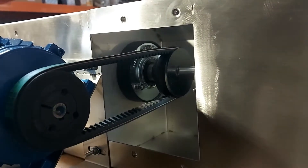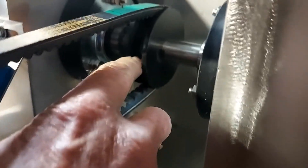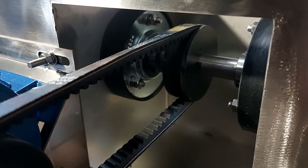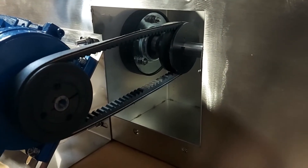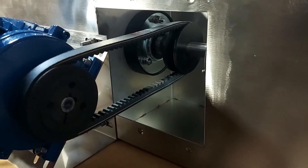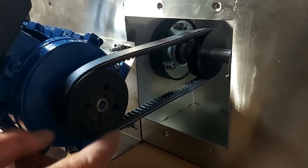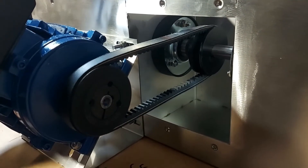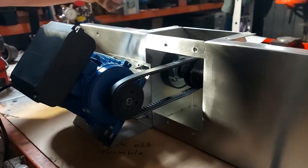It's really a simple machine. There are two set screws in the cast pulley, opposite each other on both sides. Allen keys are provided in the set — one will fit that and one will fit the taper lock pulley. If you ever do have a motor problem, sometimes the pulleys can seize to the shaft. With the taper locks, we'll show you in another video how to easily remove and reuse the pulley. It's a half-hp motor — pretty foolproof, and very simple to change if needed.